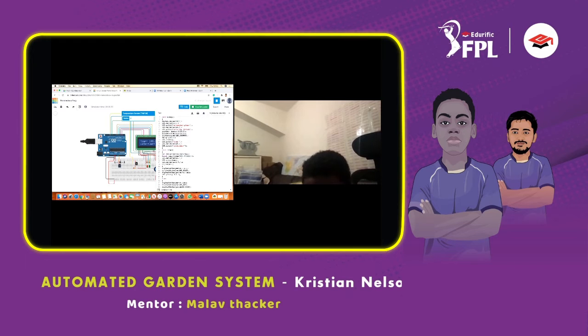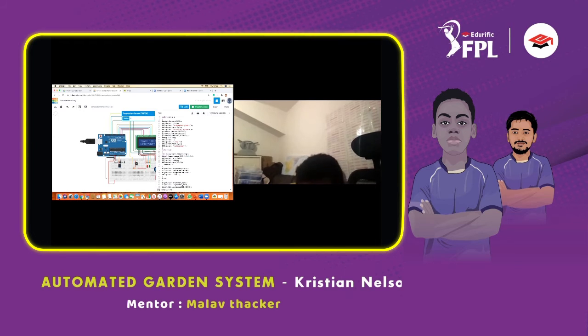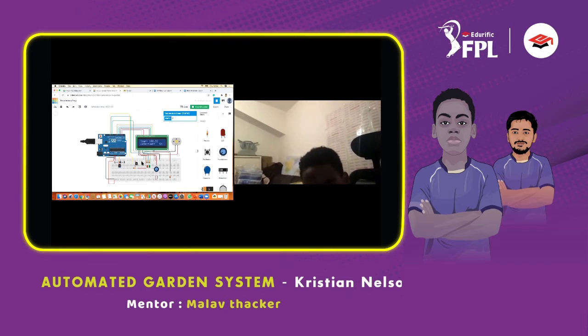There's also another LCD.print, which is temp, and I think it goes towards this temp. And this right here just means the temperature is greater than 50. So if it's not greater than 50, then the green LED will turn on and the red LED and the motor will turn off. But if it's over 50, the motor will turn on and the red LED will turn on and the green LED will turn off.